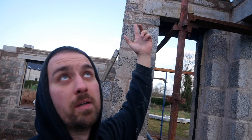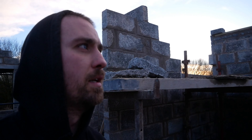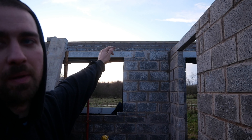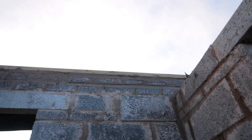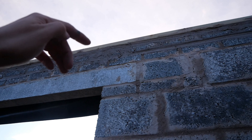And again there's going to be two more heads going across there to carry this wall, as this wall goes up into a gable, and have all the timbers on at the top there. And the wall plate — that bit of timber at the very top — what that does is it holds the roof, and gets strapped down onto these walls as well.